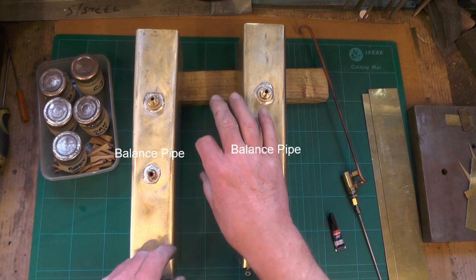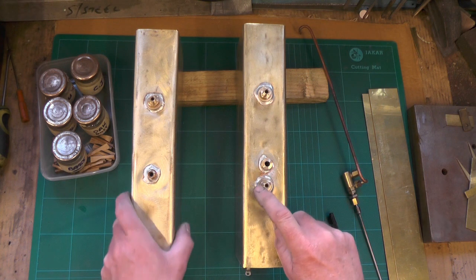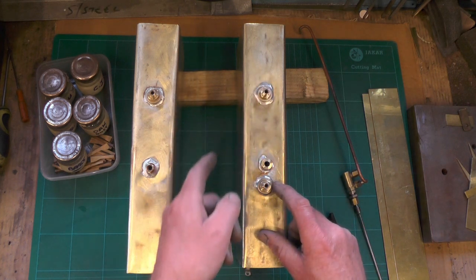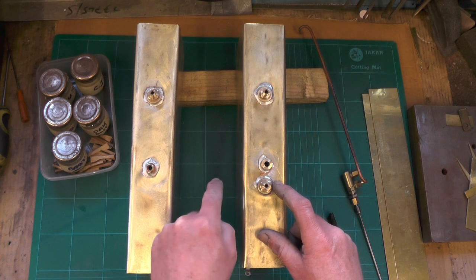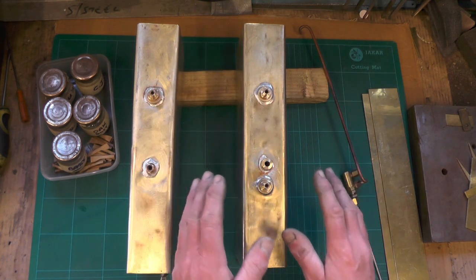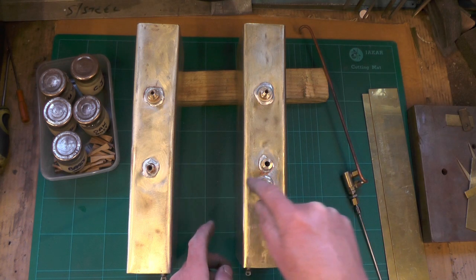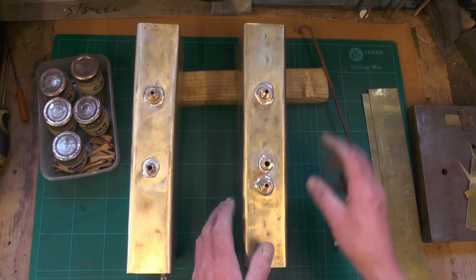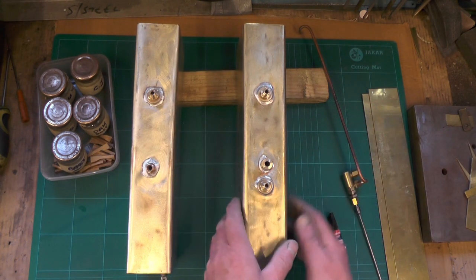And then that'll have a T-junction in the middle with a valve on to drain them. This one is the feed from the pump - the return back - so the water's going to go to the pump and return back to this one. But before it comes into this, there'll be a T-piece on with a pipe that goes off to my clack valve. When you've got your bypass valve open, the water comes through the least resistance, up into the tank, through the bypass valve and back into the tank. And when your bypass valve's closed, it goes off to the clack valve and into the boiler - so it's to regulate your boiler.